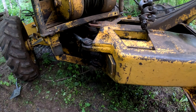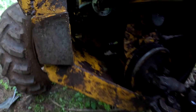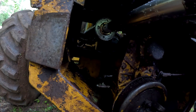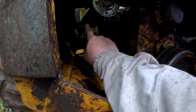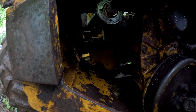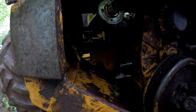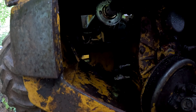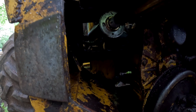I got some work to do — I gotta figure out what in there is leaking. I spent about an hour power washing this thing out. I've narrowed down the leak to somewhere on this fitting — it's either caused by the hose, the threads into the 90, or something else more related to the cylinder. I'm hoping it's the threads into the 90 or the hose, because that's a much simpler fix.